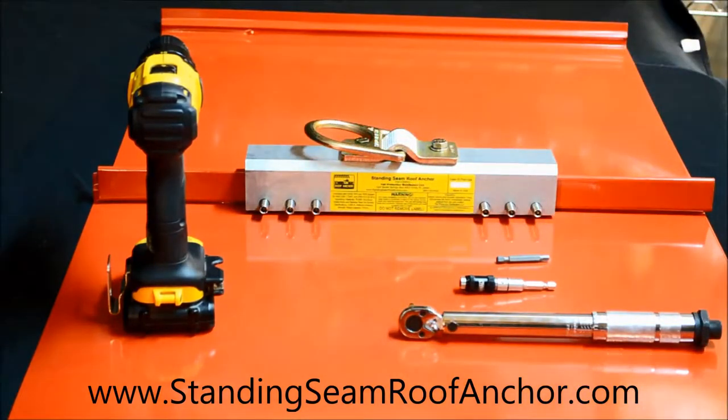So you want to make sure when you locate this on the seam, you need to have somebody, a competent person on site that knows the proper location to put the anchors. You want to be 4 feet from any fall areas, from any edges of the roof. You don't want to be within 4 feet of the end of the panel either. So make sure that you have a proper OSHA-approved safety plan of where to mount these anchors before you do anything.